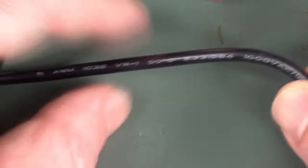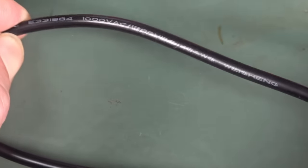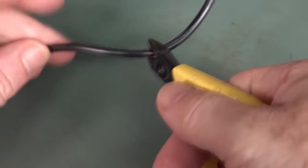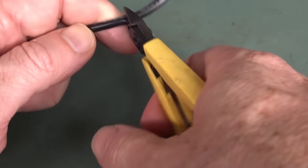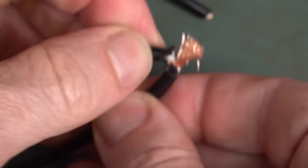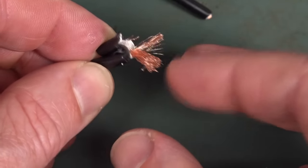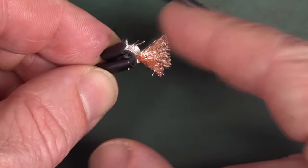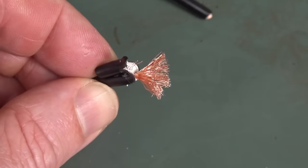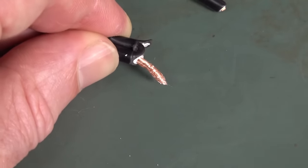The probe leads, while not silicone, are actually labeled and rated — 16 AWG. Let's chop one and see what's inside. They are quite thick, and looking at the cross-section: yeah, that looks good. A lot of strands in there — and the more strands, the better the flexibility and the longer life you'll get. You're getting yourself a lot of copper for your money.